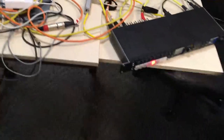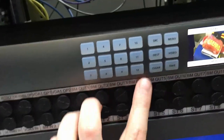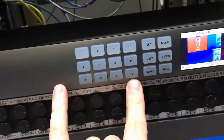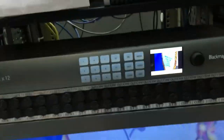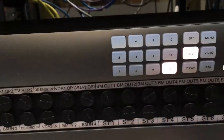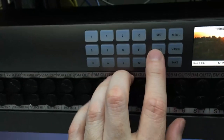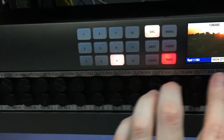I'm going to take you in to see a bit more about the capabilities of SDI and how it works for distributing video. What we have here is what we call a video router. We've got 12 outputs and 12 inputs - we can choose what input we send to what destination. I can select destination 12, choose an alternative source - let's go to the HD source - take that and all of a sudden we've got a new picture. Basically this allows us to assign sources to destinations: pick your destination, pick your source, and take that source through.